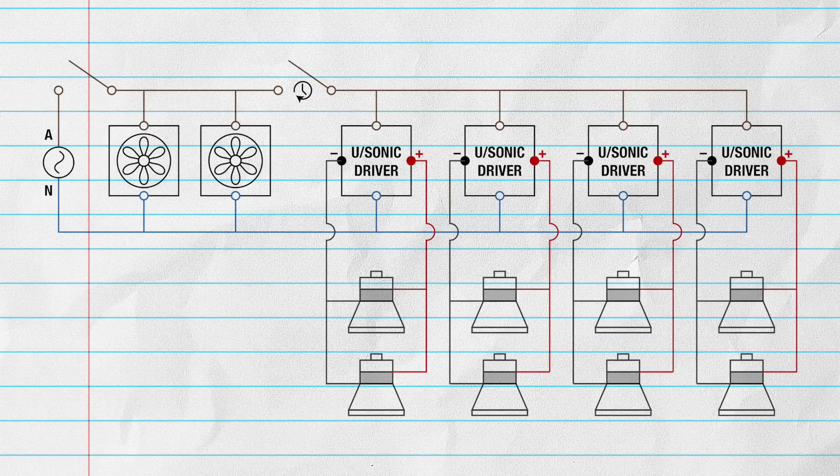I received an interesting suggestion in the comments: purchase a large off-the-shelf ultrasonic cleaner and use the innards — the drivers, timer, controller, heater, and thermostat — for my own cleaner. I would have to buy my own transducers as I couldn't transfer them without damaging them, but otherwise it was a very sound idea. Of course, my objective was always to build this cleaner cheaper than buying a new one, rather than outlaying the cost of a commercial cleaner plus my large tank — but with hindsight, it probably would have been a convenient option, though I still would have faced the same voyage of discovery with attaching the transducers. One other thing I must address: some people got upset that I didn't provide wiring diagrams — so here they are. As usual, no responsibility can be taken if you follow this and something goes horribly wrong.